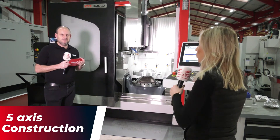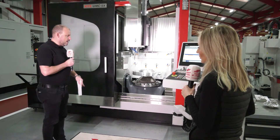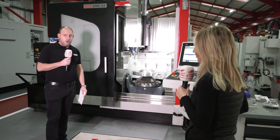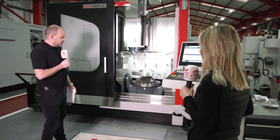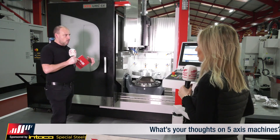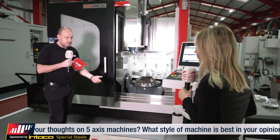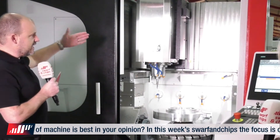From my experience, I often hear people say one solid casting is some of the best machines. This machine has lots of different options with a 5-axis, and it'd be interesting to get your opinion on whether what we talk about is right, or whether you've had experience with different styles. The base, the construction — it's all about the way the machine is built from the ground up. This is a nine-ton machine. Weight is important, but it's not everything. You've got to look at how everything from the x-axis to the y-axis is stacked and how it all goes together.